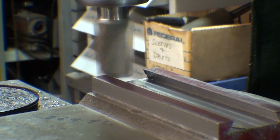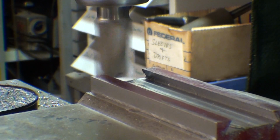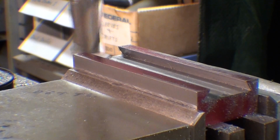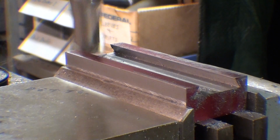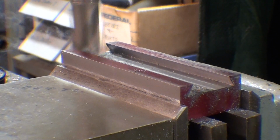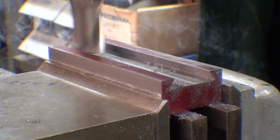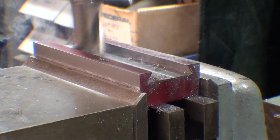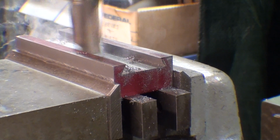That squirt bottle. So I'll run that right across. Boy, that's a dull end mill. Wow, that was the dullest end mill in the West. So I put a brand new one in there, but it's a 7/8. Believe it or not, I didn't have any more 1-inchers, and that was dull. I threw it away. I suppose I didn't throw it away because it's sharp on the periphery, but dull as can be on the corner. But this will do just nicely.